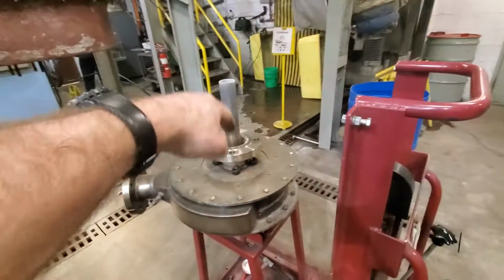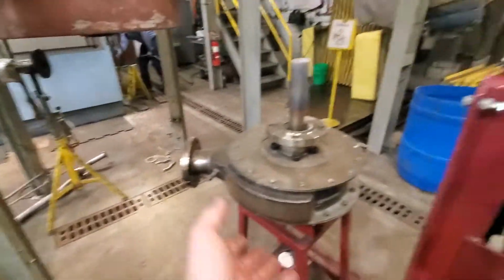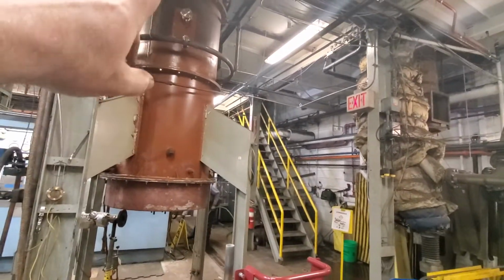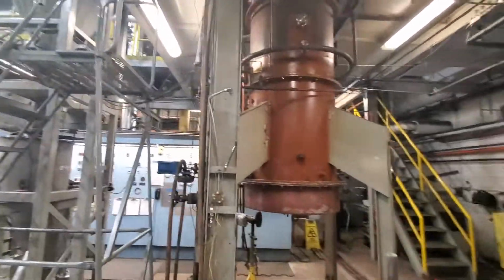You can't have that in the burner. That would cause a lot of problems. So if you pull the burner out, we can do that and put the burner back in. So when you're up there, you're going to clean out the sample port. You're going to clean out the sample filter, take the umbilical apart.